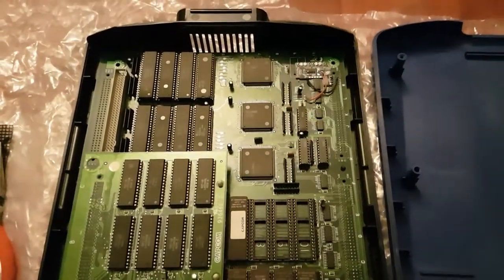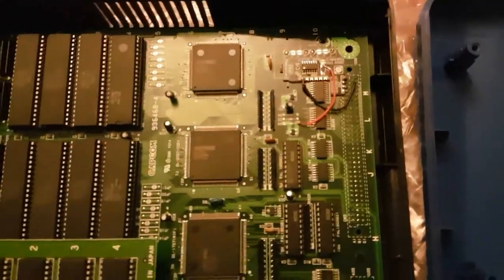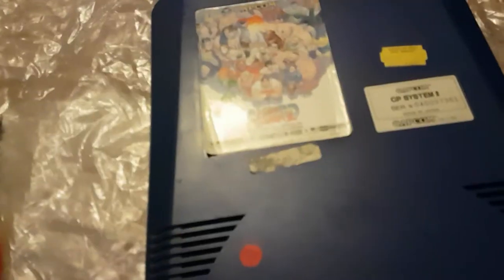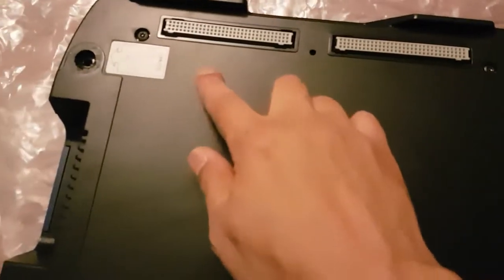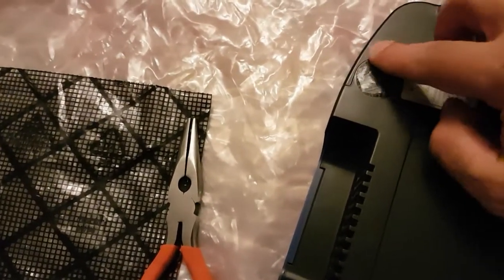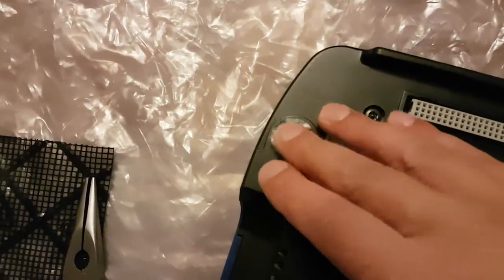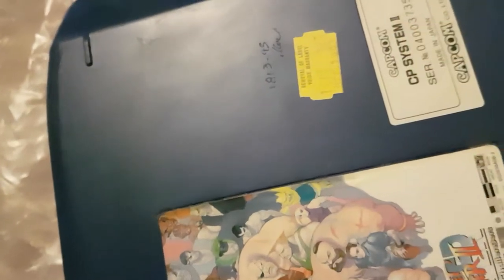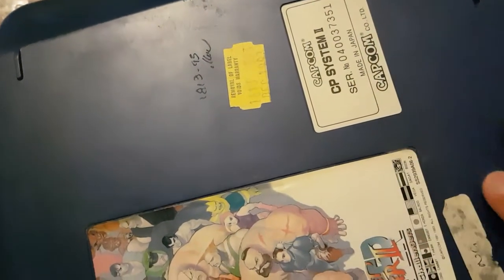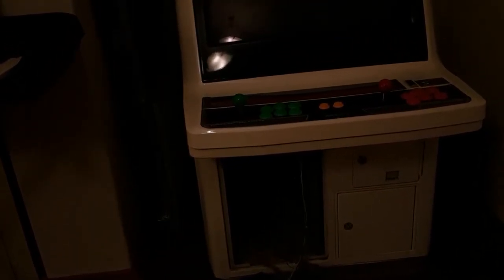What this actually does is it enables you to use these boards without having the battery installed. I could have replaced the battery, but then I would have had to do this again in another 5, 10, maybe 15 or 20 years. I didn't want that hassle, so I installed this InfiniKey. The reason is because if these boards don't have the battery or the InfiniKey, the actual game ROM loses the decryption keys and will no longer function — and this is where the term 'suicide battery' was coined by those nice guys at Capcom. You basically couldn't play the game — it was just a dead board. Installing this InfiniKey just means that the game keeps its decryption keys and you can still play the game.